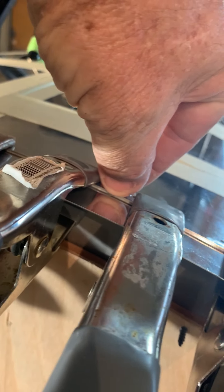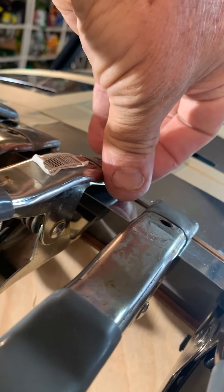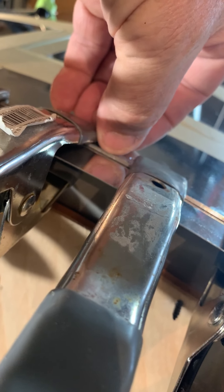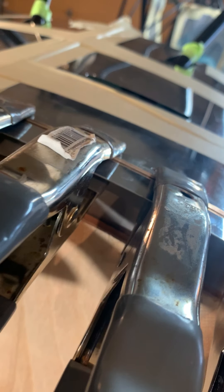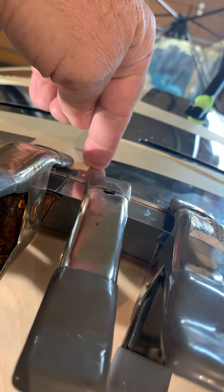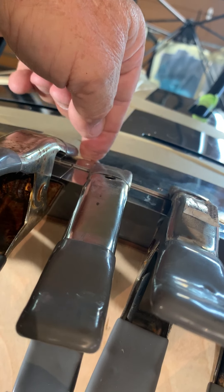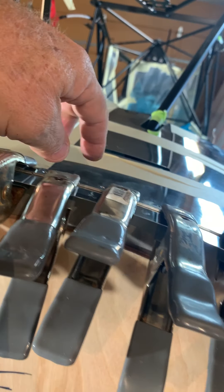The small shim is the spacer. Later, when our cowl comes up here, it's going to have the thickness of that shim and the boot cowl, so it'll come up and meet flush with the edge here — that's the purpose of that inside shim. The notch on the big one goes up to this side and inboard, that little notch on the big shim. And the little shim, we match it up to it — we put a dot and an arrow; the dot's up here and the arrow's pointing that way.